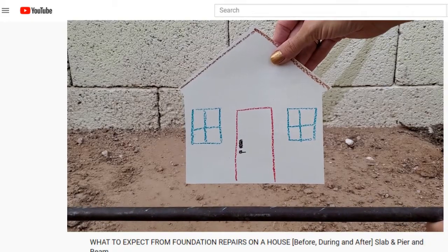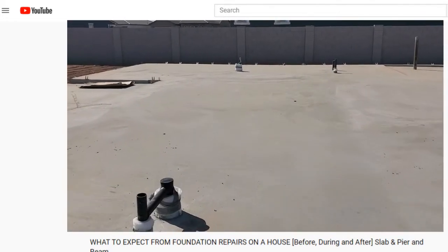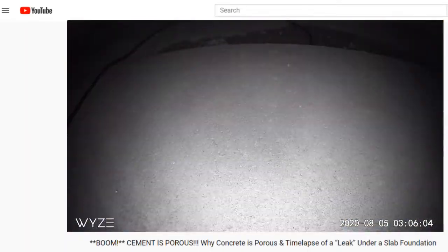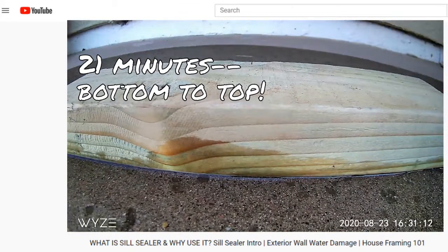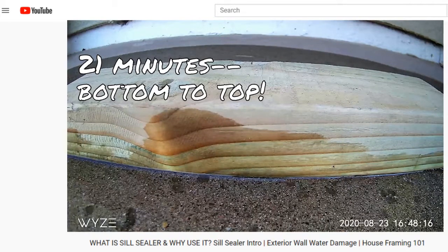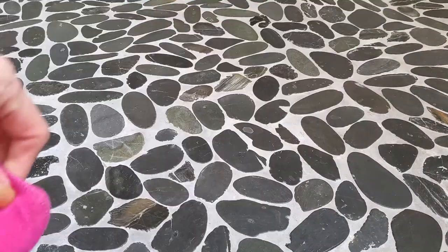Step eight: pop tiles or soggy carpets? Concrete is porous. Even though the plumbing lines run below the slab, a leak is a constant source of water soaking into the concrete — especially if the slab was not prepared with a vapor barrier or if it was damaged during the pour. A crack in the slab will allow water to percolate up quickly. If water makes its way to the top, the mortar gluing your tile will eventually disconnect from the saturated cement, starting with a creaky tile. You may also get a damp sock in a carpeted room, or see cupping with hardwood flooring.